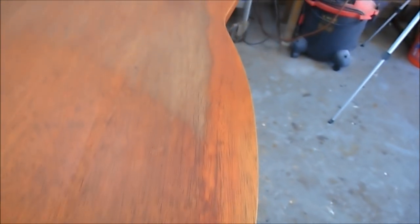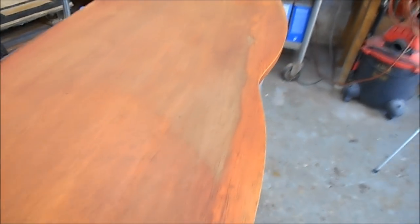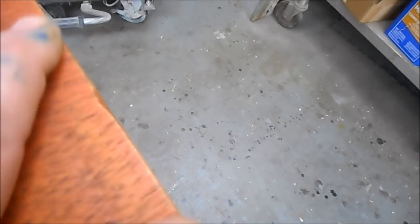We've got a pretty good whack right there on the top — we'll fill that. The biggest issue is that lightening and the opening of the grain, which is quite open now from long-term moisture exposure. That's what killed the finish; they'd covered it with a blanket that must have trapped moisture against the wood. It's about half the dresser. As for the cigarette burns, the first was barely to the wood and the second is a little darker but no indentations, so those should be fine. There's also a small veneer chip and some other minor repairs.